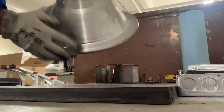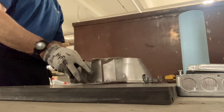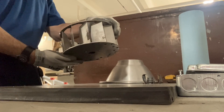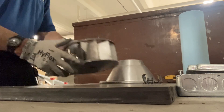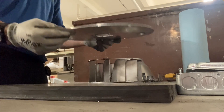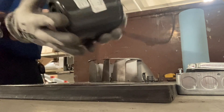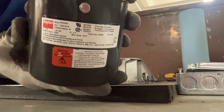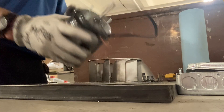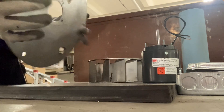Here in the maintenance shop, we're going to start the assembly process. That's the motor hood, and there's our centrifugal wheel — you'll note there are two set screws that hold it to the shaft. Make sure you leave those counterweights on the centrifugal wheel; don't take those off — it's balanced at the factory. This is the base plate that the motor will mount to, and here's our new motor. You can see it's also a Dayton but a different model number, even though the specs are the same. There are our two wire leads, so pretty straightforward.